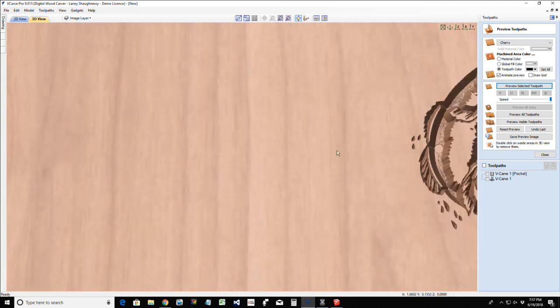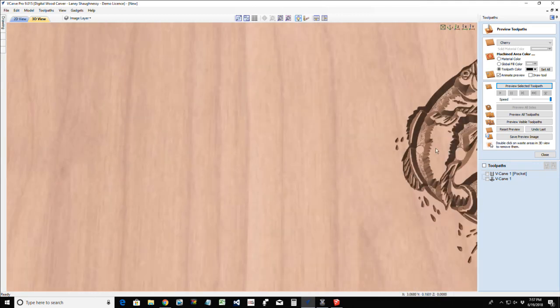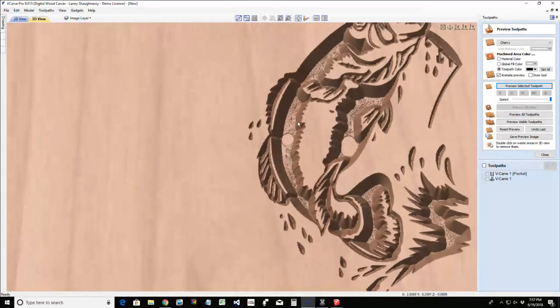Nice little carving. Now my 1/8 inch tool was way too big, right? Let's move over so you can see it. My 1/8 inch tool was too big to fit into a lot of these areas. You can actually see this clearing right here. This clearing is where my 1/8 inch bit could fit, these two clearing areas. But if you notice these marks here, my V-bit actually had to do a lot of cleaning up. Now for me,